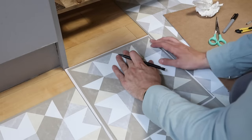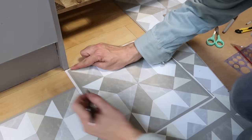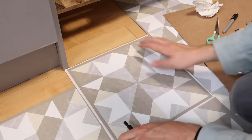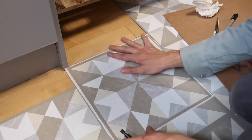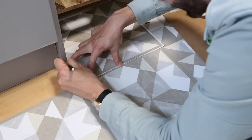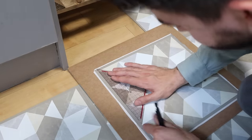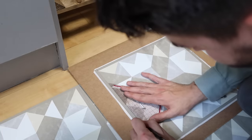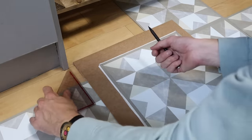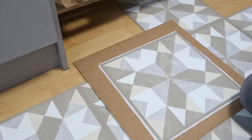Starting to do some fiddly bits now. This tile doesn't quite fit here where the kitchen cabinet is, so we have a tiny bit of excess. I'm just going to mark what that line is and then measure how deep that's going to go. I'm going to draw a line between the two — actually it's just the borderline on this which makes it slightly easier. So we can see that should be the piece that we cut out. If you wanted to be extra careful you could measure this piece as well. That goes to 40 — yep, that's the same so we know we're correct. I'm very carefully using the blade going to cut the tile.